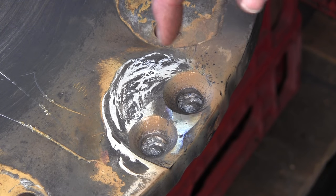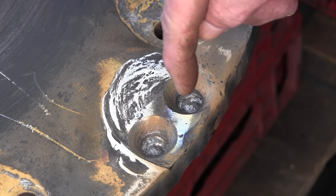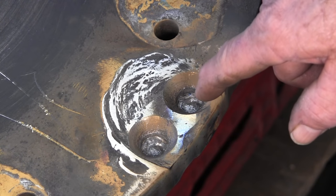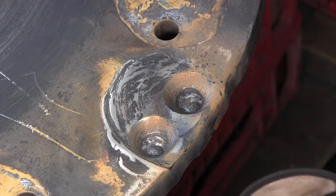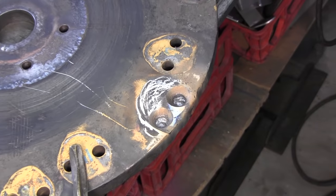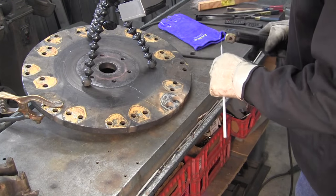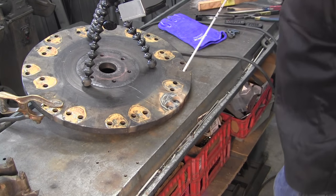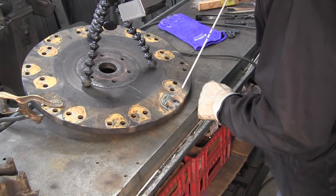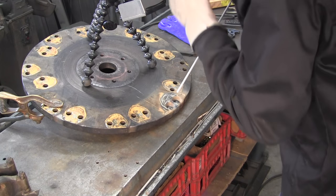Now I want to continue. I'm going to take a block and put it underneath the far side of this plate because I want it pitched up — I don't want to go down in there and create a slag trap. I'll start on one side and work my way to the other side. With the plate pitched up at an angle I'll be able to do a vertical-style weld and know I'm getting 100% weld penetration and not leaving a pocket. This first pass on both sides is pretty crucial — you just don't want to make any pockets.